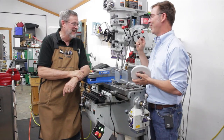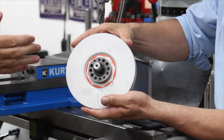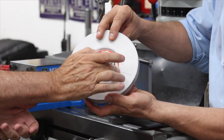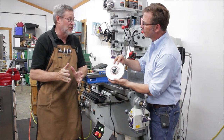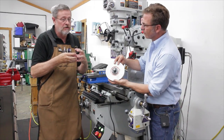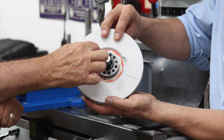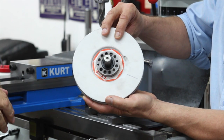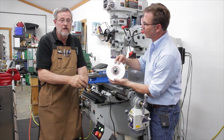That is a great solution, but then you had to take it to the next level, which is what I really, really like. You see videos and people talk about grinding out part of the wheel to balance it because they weren't getting a good finish. And you can buy hubs that adjust for balance — they're very expensive, $150. So I machined new nuts and drilled a series of 5/16-18 holes around it. And you can put different size Allen screws in there to get it to balance. You just swap them in and out like moving weights on a tire.